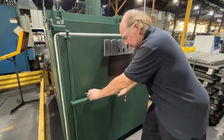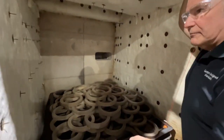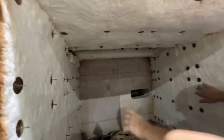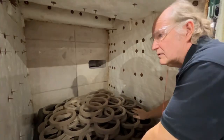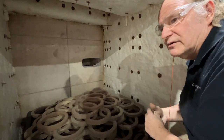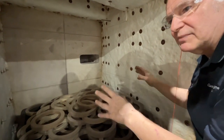Let's take a look at the oven. This is the lower chamber of the oven — it's a metal box that's insulated. There's an emergency vent up there. Down here is where you actually burn things off. We take parts, whether they're motors, whether they're ceramic rings like this, or whether they're any parts, and we put them in this lower oven chamber, which is either the main chamber or the process chamber. Down here it operates at 600 to 900 degrees depending on what you're doing.